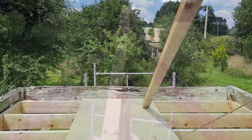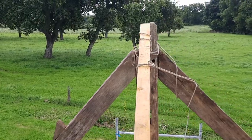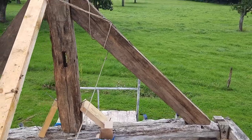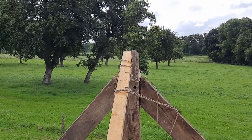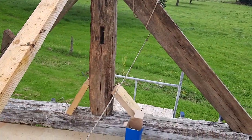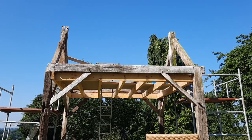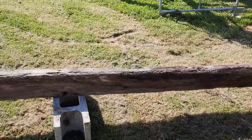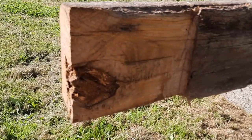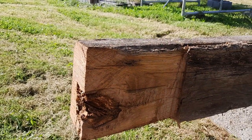I've just got the other section on and it's okay — we've got some adjustments to do. It's not going to be dead level on all sides, but we're in luck: they fit in the pockets. Both A-frames, left and right, are now in position and ready to accept the top ridge beam, which joins the two A sections together. I've just trimmed the end of this up — there's a bit of rot there that'll be cut out — and I've cut it a bit longer. Here goes.